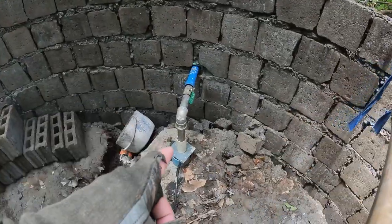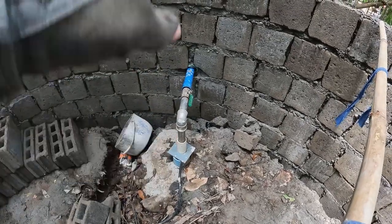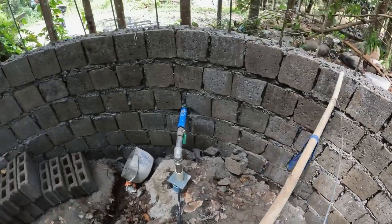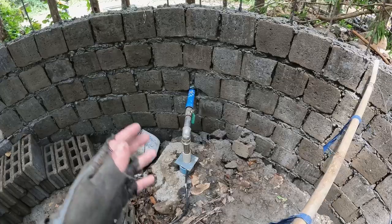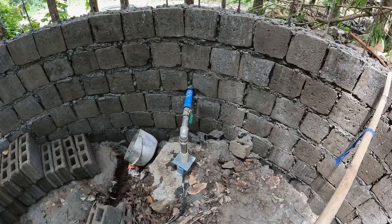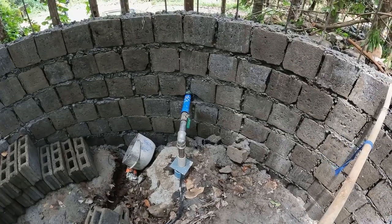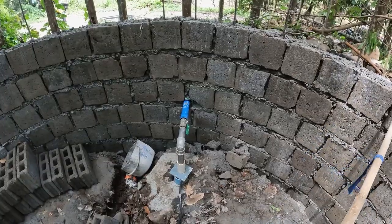So here is our outlet from the ground. Right now we're shooting the water out, because I still want to run it. They say keep running that, don't let it sit too long, or else you'll possibly get a lot of sediment down in the motor. So we added that little pipe just temporarily so we can run it 30 minutes a day, and plus they can get fresh water out of here for the concrete mixes that they're making.